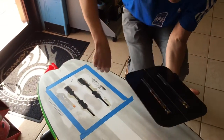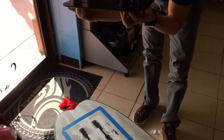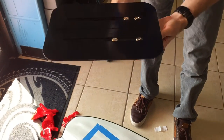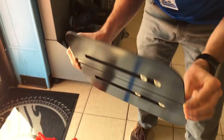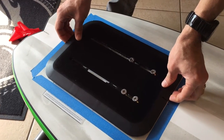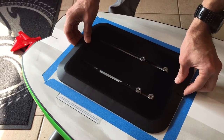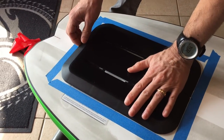You can see we got our area here nice and outlined. I'm going to flip this over and get this thing stuck down, just making sure these screws aren't too far up — you want to make sure these are flush so it will stick all the way down. Also, make sure you install it with the T-nuts on the inside; they need to be captured inside that track for it to work properly. I'm going to visually line it up on the tape we put down — I'll get two corners, stick down one corner first, and then work on the rest.